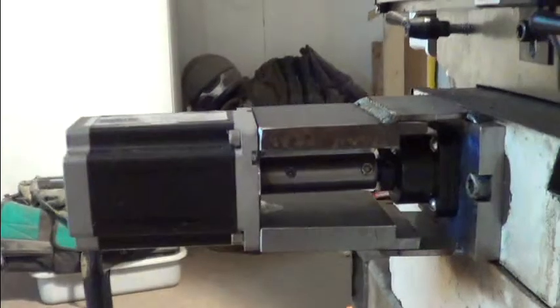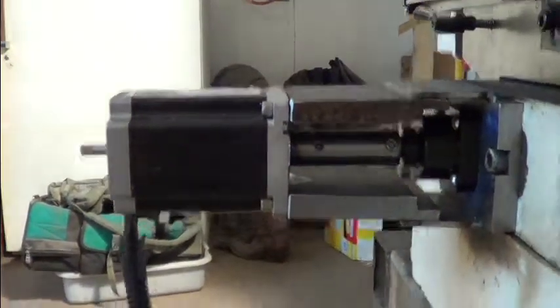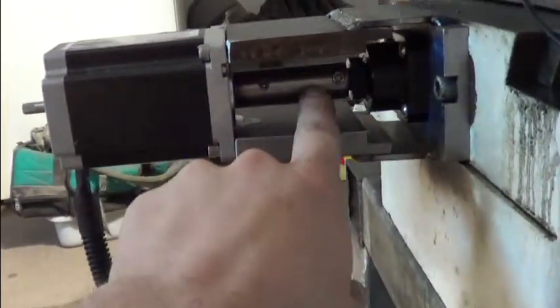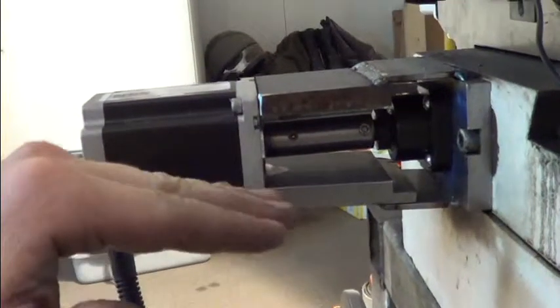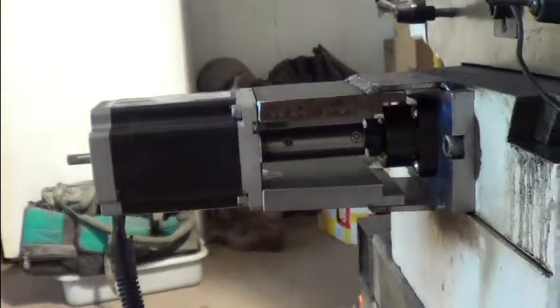This is how I just kind of temporarily got them set up. I got some flexible couplings coming. I had to loosen them up because I didn't drill this straight enough, so it makes the motor move about a degree. The flexible driveshaft coupling should take care of that.